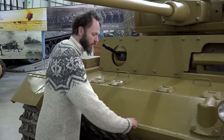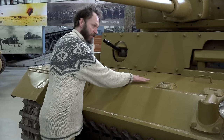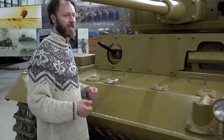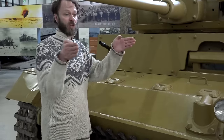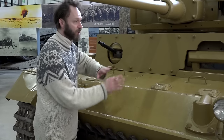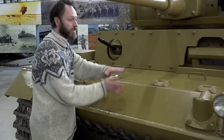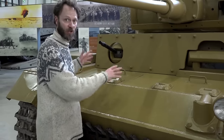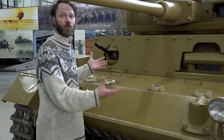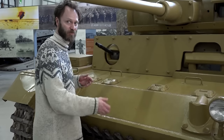You can see these lines of welding - a slab of metal welded to a slab of metal welded to a slab of metal. This is a different construction method from the very early World War I tanks, which had a framework to which plates were riveted. This has no framework - the body of the tank is made up of its shell, so the slabs welded together are the strength of the tank. The outer armour box is also its own framework; these are not added to some pre-existing skeleton.